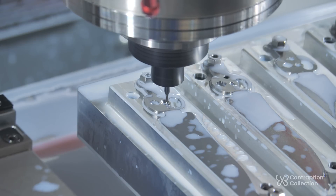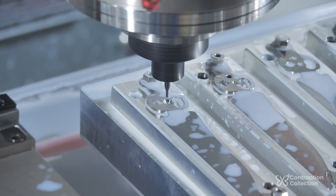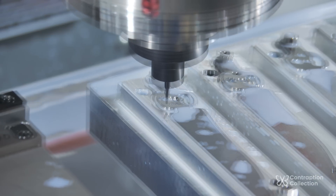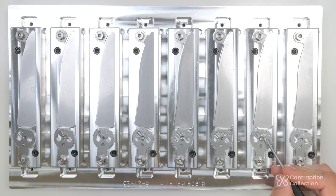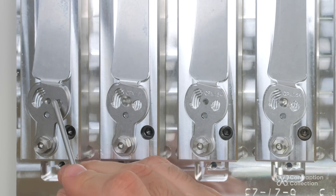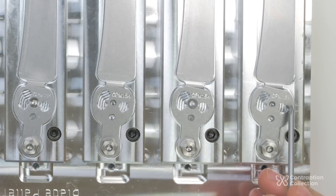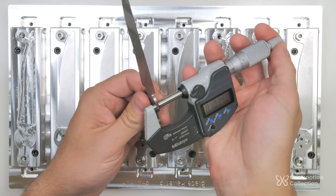One last thing — I should have done it a long time ago. I can engrave the steel type on the blades, and it should look better if I cut it with the blades at an angle, so I'm not using the very center of the tool. The engraving is at different depths, but because I'm using a ball end mill the difference is probably only a few thou. But a few thou is big in the machining world, so actually I am upset. I guess my blocks aren't all the same height.